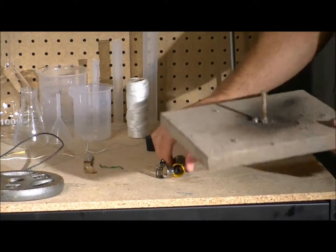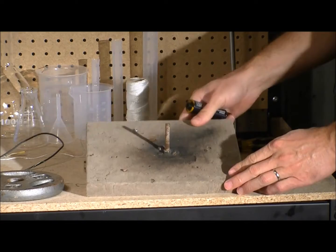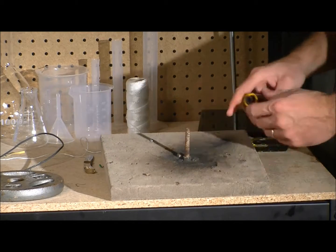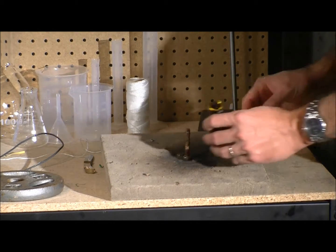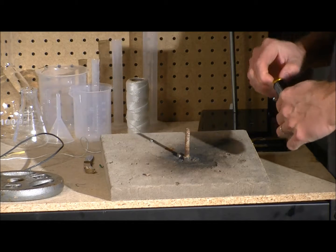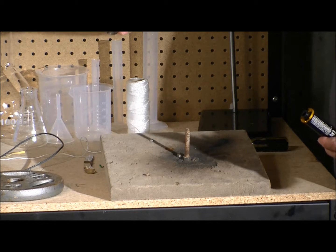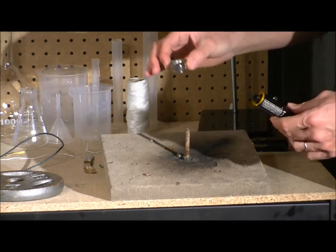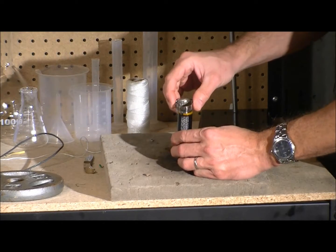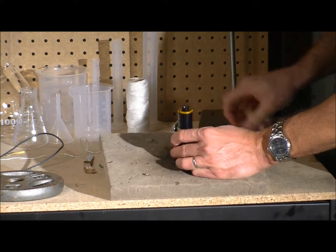Okay, the other thing that I was asked to demonstrate is connecting the rocket motor to the actual force plate itself, and here's the force plate. And what we have is just a 1/4 inch bolt coming up out of the force plate and rigidly attached, so that whatever we rigidly attach to the bolt is also rigidly attached to the force plate. So this is an example rocket motor, and we use a hose clamp because a hose clamp is made of metal and can grab it rather firmly, and there's no give like there might be with tape or tying it with a string or maybe wrapping a rubber band around it. We really want a rigid connection, so that's why we use the hose clamp.